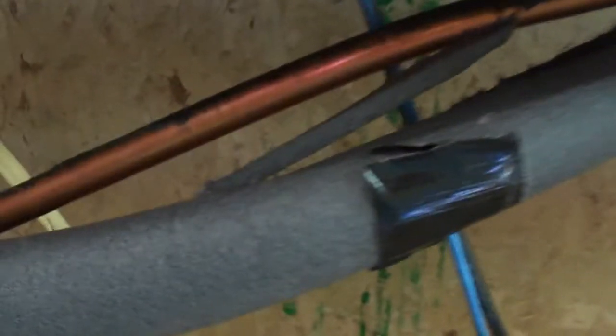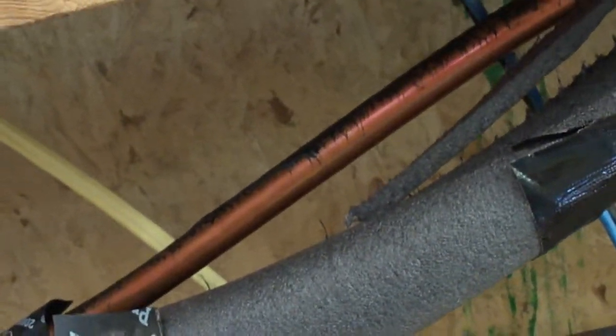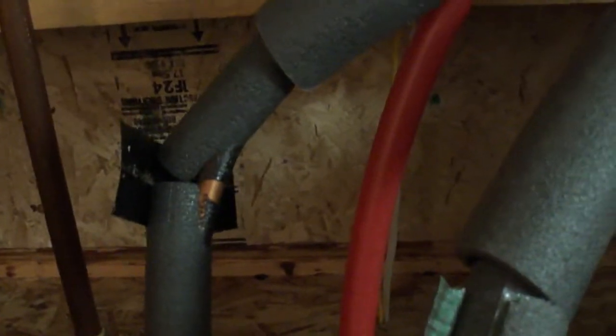I ran the collector loop in soft half-inch copper. My flow rates are telling me I can go to 3/8-inch copper even though I'm using a tiny pump — I'm getting a gallon and a half per minute in a 50-foot run of half-inch OD copper, or five-eighths OD copper. There's another high-temperature mark here from when the pump started and pushed some really hot water down.